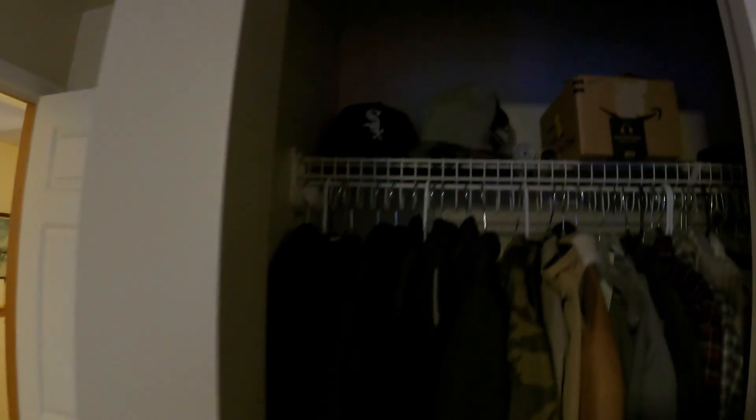What we're going to end up doing is a two-part series. We're going to put an LED strip right along there, so as he opens the door or walks up, motion will turn on the light for a couple of minutes and then turn it back off. But in order to do that, we need to put a wall outlet on the inside of his closet, so we're going to tap into the wall outlet on the other side of this wall and put another wall outlet in there, so we can plug in the LED light and make it look nice and seamless.